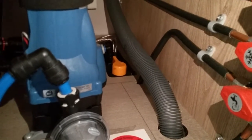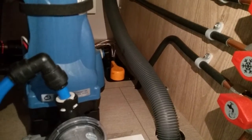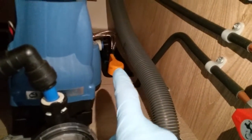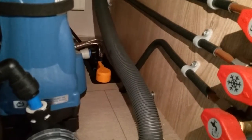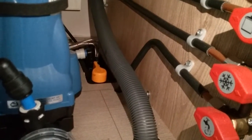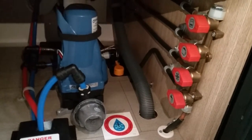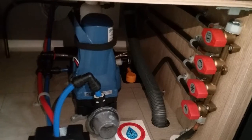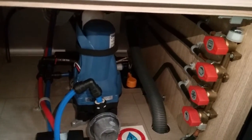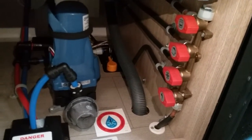So when it comes to refilling this boiler, firstly make sure the taps are reclosed again in the motorhome, fill up the fresh water tank, make sure your drain valve is back in the position it is now, turn on the water pump, it will then begin to refill the boiler, let it run for a few minutes, then begin opening the taps. They'll cough and splutter as they force the air out, and then once the water is running freely, reclose and the system will fully reprime itself.